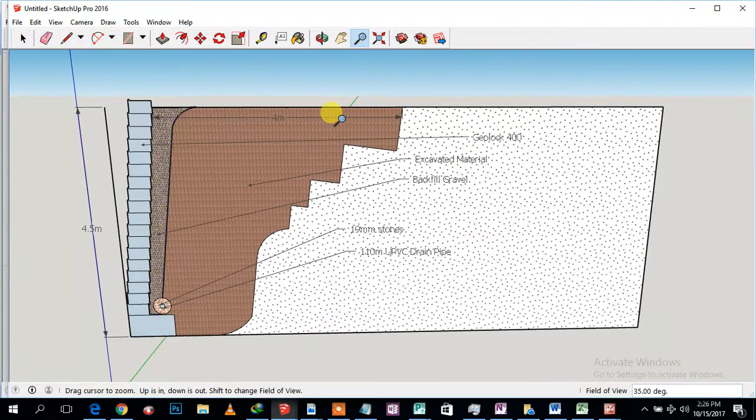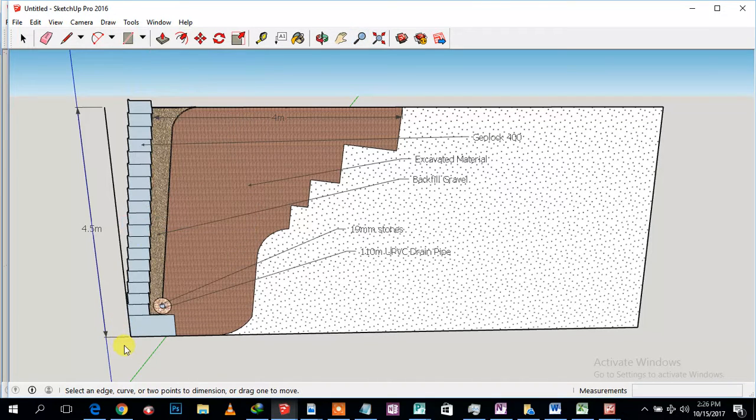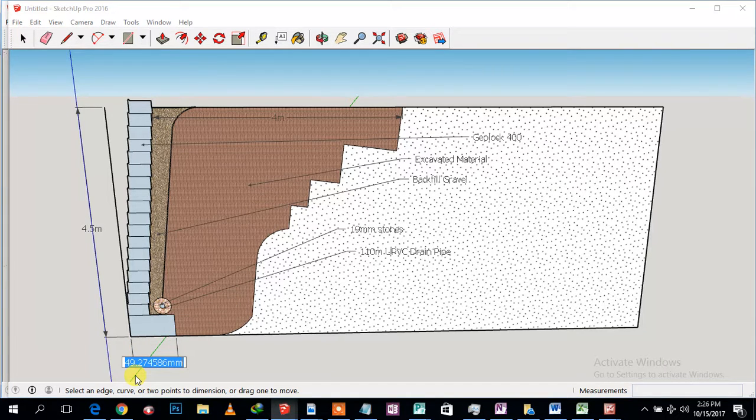So basically that's the main aspect of this project, and the other most important thing is the footing. Normally for walls exceeding 4 meters, the trench along all the walls we make as wide as maybe 700, right? That's the width, and the depth we could make like 800. That's the depth of the whole trench.